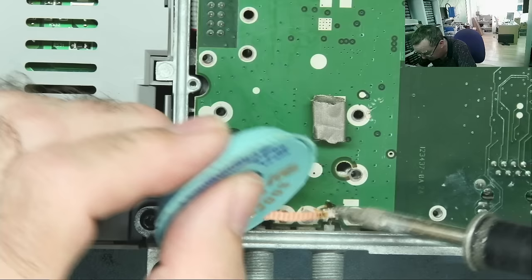Yeah. This looks like it's a 12 volt supply, or should be. That's wandering around a bit. You see it? There, you see that? That moves around. This, I think, is the same. I think these two pins were connected to each other. Yeah, same problem with that. I'm assuming that's a problem. No, I think we had a ground. Then we have three more that could be supplies. That's a 28 volt. And that's all the supplies on this seem to be wandering around a bit, actually.